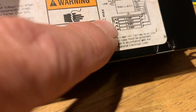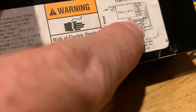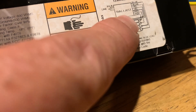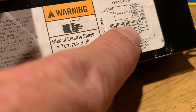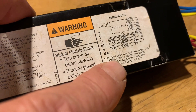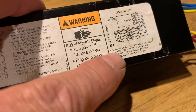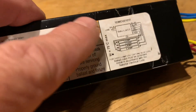Plain and simple — they got it color-coded, they got it labeled. This is a four-pin, four-foot lamp. I got it into shunted sockets here and shunted sockets here, or jumped-out sockets. For three lamp, cap one blue lead. Ballast case must be grounded and installed in accordance with the National Electrical Code. When you bolt this into place and screw it in with your machine screw, it is automatically considered bonded.